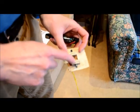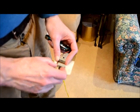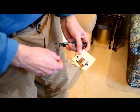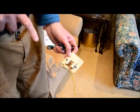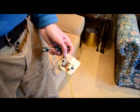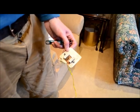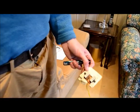The control's just two simple reversing switches with an off central position, so that's forward and that's back, and each motor's got two wires controlling it. So that's a really simple way of controlling a robot, but the difficult part of designing the robot is designing the mechanics of how it goes up and down stairs. The remote control is a separate problem. So you can separate the two problems. Mm-hmm. And that way you don't have to spend any money on that, and it's fairly reliable.